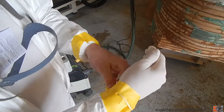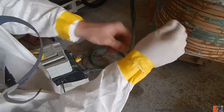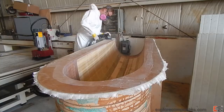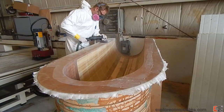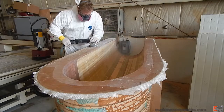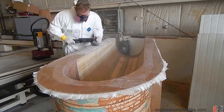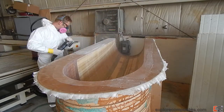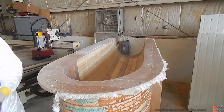First I had to do some grinding, so I carefully taped my wrists up to avoid getting fiberglass up my sleeves. I taped the suit, then taped the gloves to the suit, and went over the whole thing starting with the flange. I was careful not to burn through the glass. Here I'm taking down some of the laps where the glass has to be smoothed out and taking off that nasty edge.